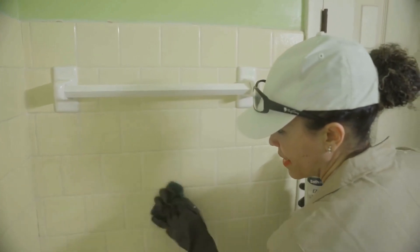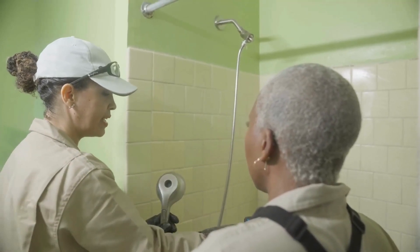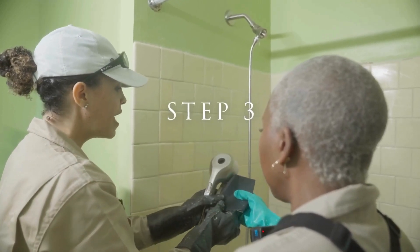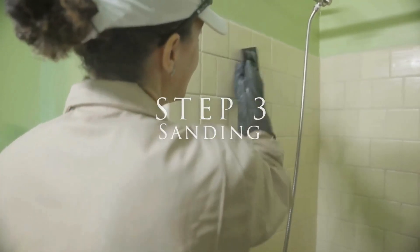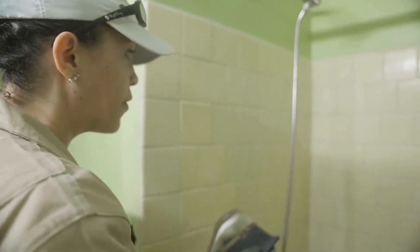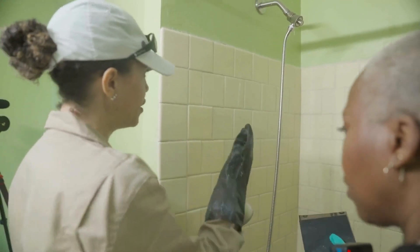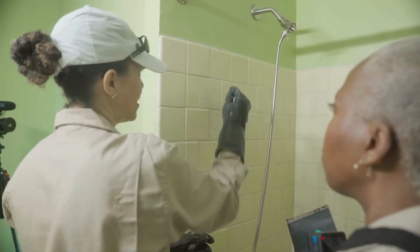If you're not concerned about painting a fixture, you can put some painter's tape, a paper bag, or something to tape it off so it doesn't get sprayed. We're going to start rinsing this off, and as we're rinsing, we'll take the 120-grit sandpaper and sand the surface at the same time to further roughen it up so the refinishing spray adheres properly.